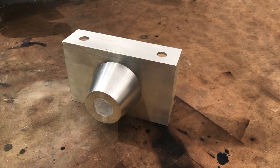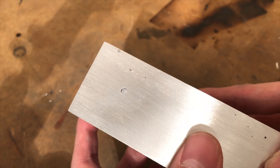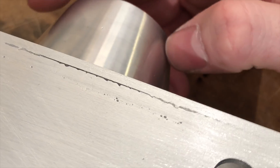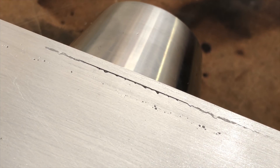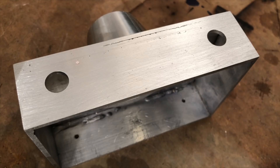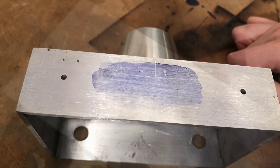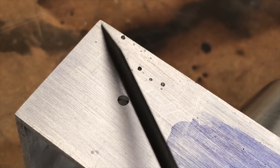With the body now completed, I wanted to address some of the mistakes and imperfections that are a result of the welding. This is a new process for me, so I can't ignore these problems if I'm to get any better. The most glaring problem is the top seam that came open when I clamped the nose cone in — it looks like I didn't get good penetration here. I don't think it will be an issue though. Once the camera is completed, this surface will be covered up. Furthermore, the clamping force this part saw when attaching the nose cone is far greater than anything we'll see again. There's also a lot of porosity on both the top and bottom, which I believe is due to contamination of various kinds. Moving forward, I'll be much more aware of cleanliness to minimize these sorts of problems.